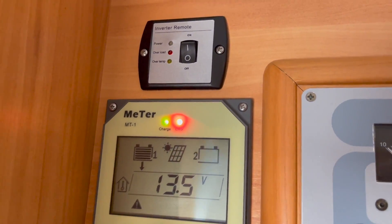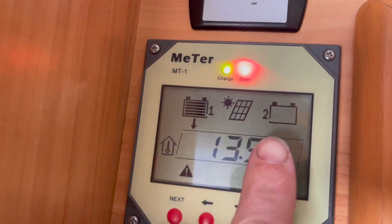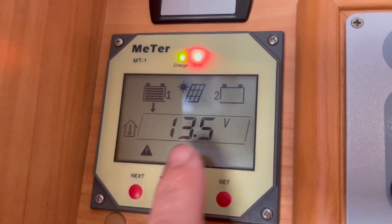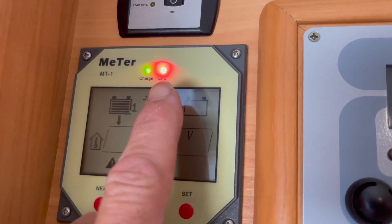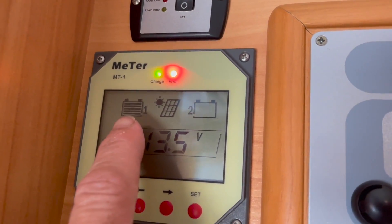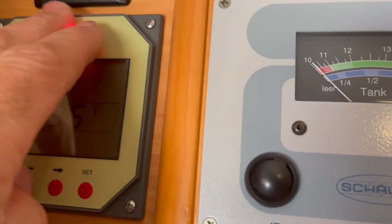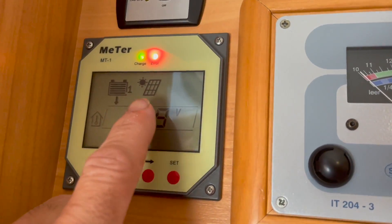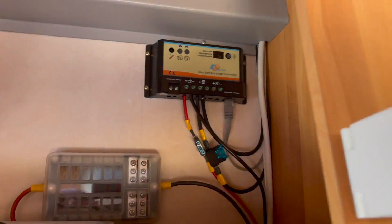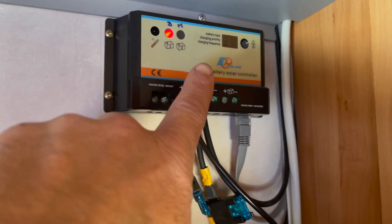Since changing to a single battery, the solar panel is charging fine and the battery is fully charged, but battery number two position isn't doing anything. No matter what you do to the settings, battery two always remains and the error light stays on. We can't find any instructions to prioritize battery one and ignore battery two. So we're going to replace the controller - the old one will stay and we'll probably put a panel over the space. Maybe at a later date we'll put a Victron BMV 712 in, depending on what the customer thinks.